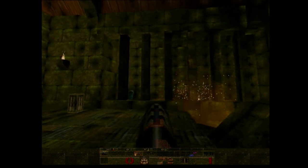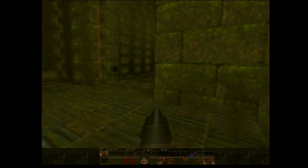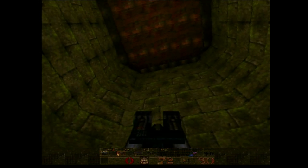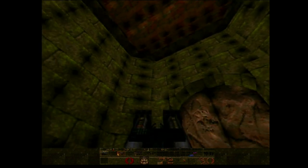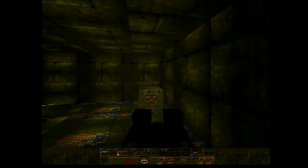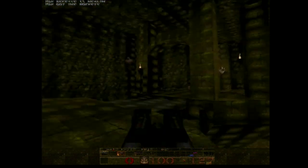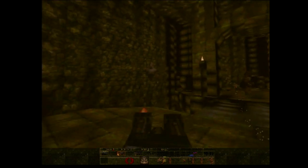So yeah, I do think we have some broken RAM or maybe some trace damage or something. You can obviously check all the soldering joints on the chips again. I did check them all before and I can't find any that are loose or anything, and any suspects I checked. So yeah, I suspect the RAM or the TMU to be bad, which wouldn't be surprising either considering the state of the cards.